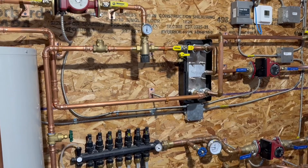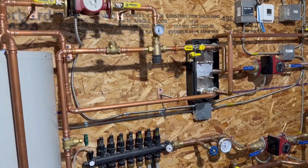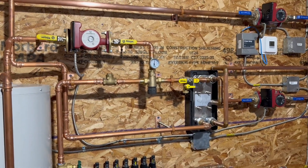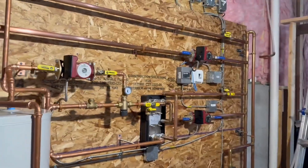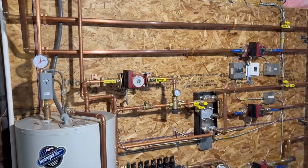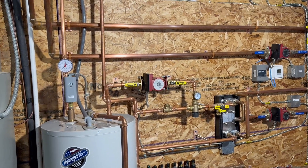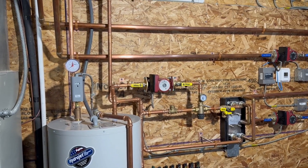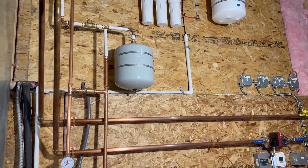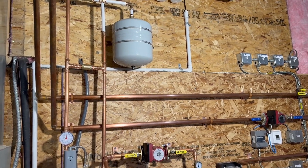The other issue I saw in a lot of those setups is for the thermal siphon, there would have to be some kind of a recirculating line to allow the water to cycle. So my system has a pump and a mixing valve, and I just wanted to share that and maybe get a little bit of additional feedback. The wiring is still a little bit sloppy because I feel like I may continue to tweak this. The way this system works, we have a check valve first, and then we have a four-gallon thermal expansion tank.